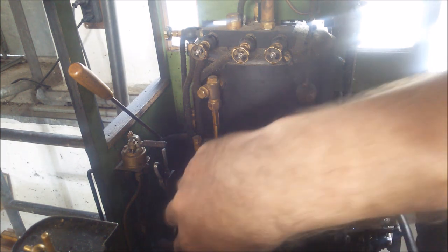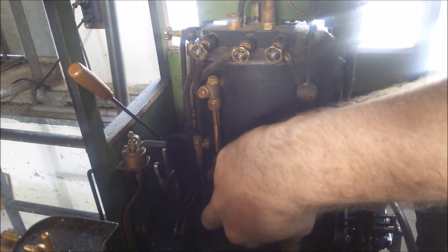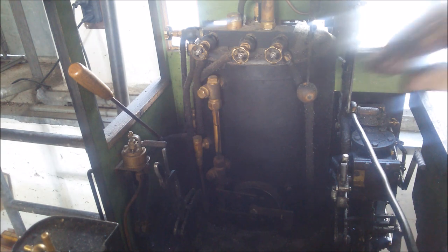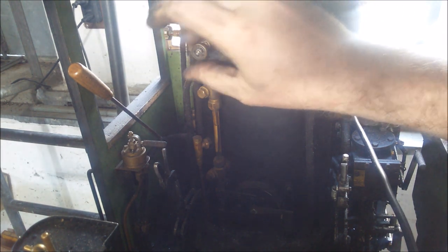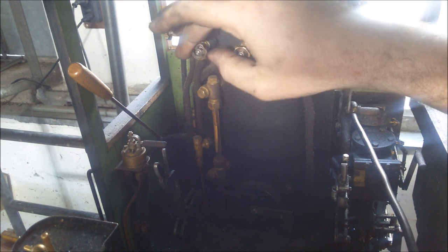Once the fire is burning well, the steam valves on the manifold are closed. They had been opened when the loco was set aside to prevent the valves from jamming. When the boiler is filled, air can vent through the open valves as well.